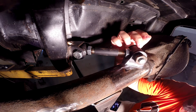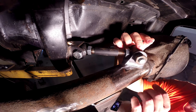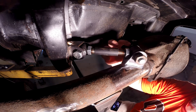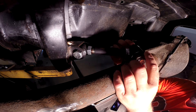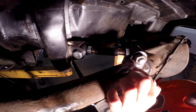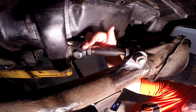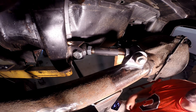What we did on this end was we mocked this up and set it down, and where we ended up was in a position like this because this bracket on the far side was too wide. So what we did was we leveled it up, then we scribed the back side to see what material needed to be removed, clamped it to the bench, hit it with the grinder, and removed that material. We did the same thing to this bracket — this side didn't need nearly as much material removed. Now we've got the bolt for this joint in the same plane as the bolt on the bracket on the frame, so we're all ready to tack this thing together.